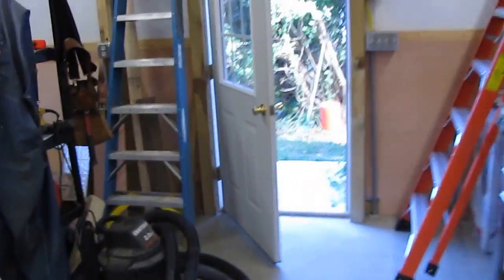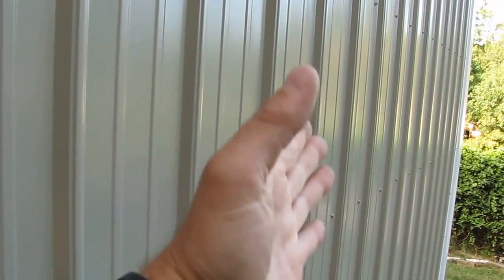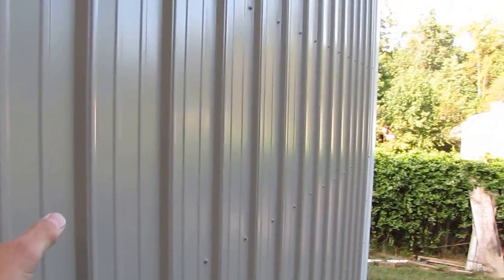And then I'm not going to cut a hole in my overhang, because that's just a waste to me. I'm going to build standoffs. That's about a 13-inch overhang up there, so I'm going to build with the custom kit. I'm just going to build standoffs, come away from the building, and put my pipe and everything on standoffs. You know, build it off the wall, so I don't have to cut any holes, except through the wall, where I'm going to have to cut a hole right through there. But the chimney is going to be up 8 feet off the ground, or 9 feet to the center.